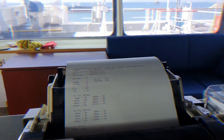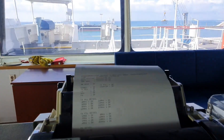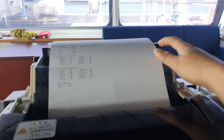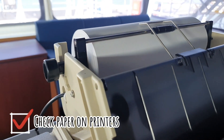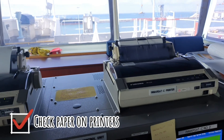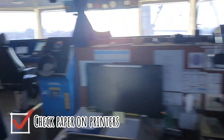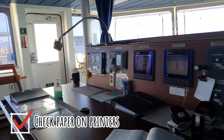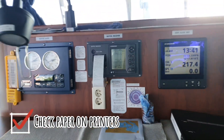Our MFHF DSC has a printout on its daily test, so you have to retrieve this and sign for your filing. Next on our list is to check the paper on the printers. For most GMDSS stations, the printers are from the Inmarsat C — printers 1, 2, and the printers on the outer decks. Check if there is still paper in them.